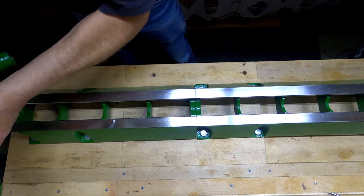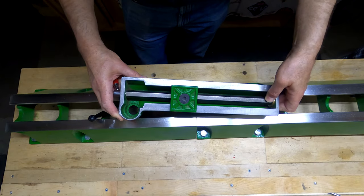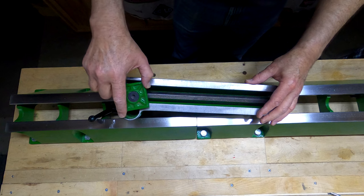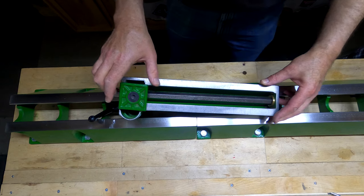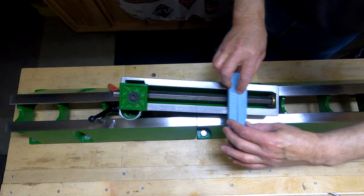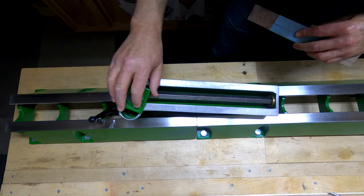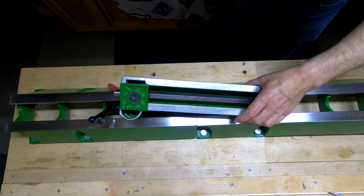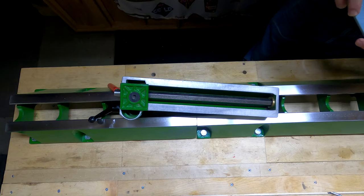If I want to go a step further, I can take this banjo off and just set it in here, and I can sand this. To do the whole thing I would have to take it apart, and I've done that in the past — it's a pain to get it put back together properly, so I'm not going to do that. I'm simply going to take my sandpaper starting again at 80-grit and just run it across here. Having this sit in the bedways, it's locked into position at least as well as anything I could build to hold it, so I'm going to leave it there and start with 80-grit sandpaper.